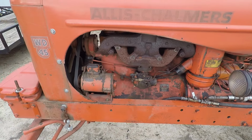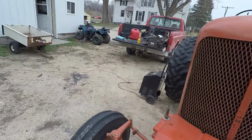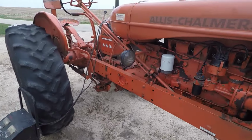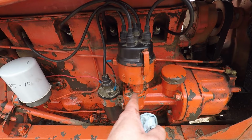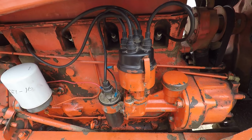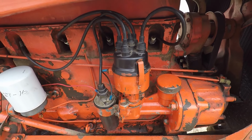Okay, cool. Always thought it was the carburetor. Thought it was the points. Maybe it was. Ended up being the distributor. Yeah, so the gear moving forward and backward in there was allowing the timing to change slightly, and it just would not run that way. So, yeah, kind of cool. Not something you see every day.